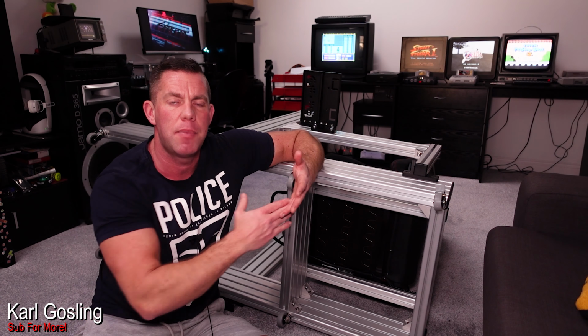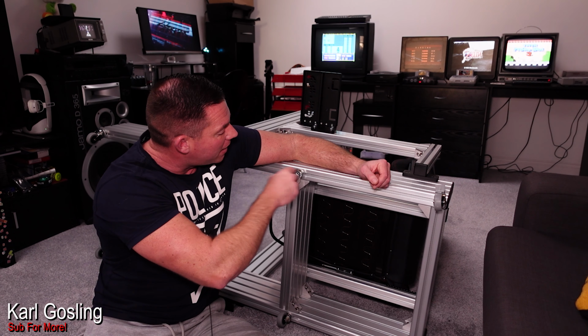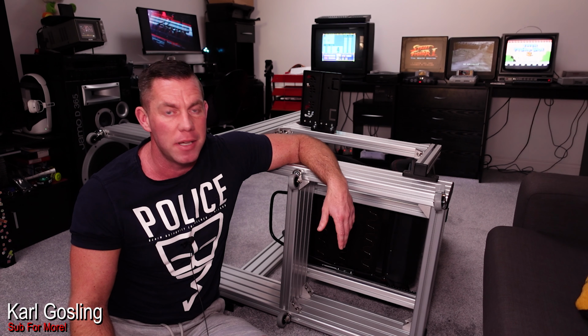So anyway, long and short of it is I got these ones. I think they were from Amazon. I will put a link to them in the description. But I basically decided upon them because they were the nearest I could get in thread length, 15mm, correct thread diameter, M8 obviously, and I looked at the thickness of the metal that they're constructed out of and just chose the ones that look the thickest out of all the ones available across eBay and Amazon, because most of them are going to be crap.